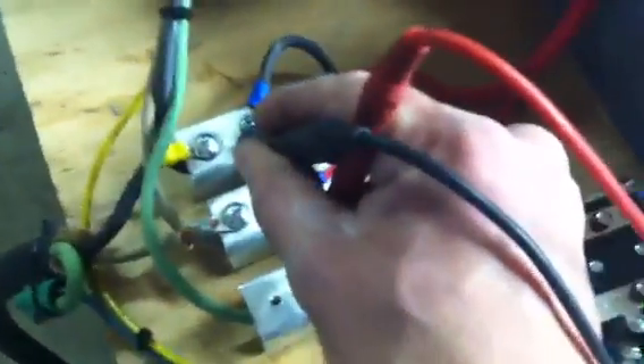It fires right up. Checking voltage between our phases: between the phantom leg and one of the good legs we've got 235V; A to C is 240V; and B to C is 242V. That's basically it.